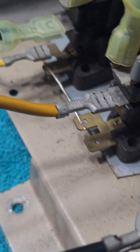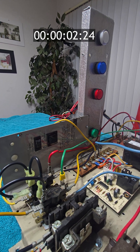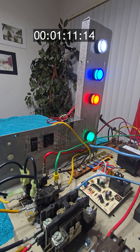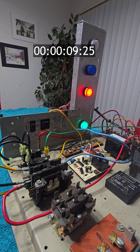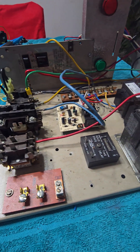If you don't want that, you can simply cut that bar out and run different control voltage so they can be powered independently. Let's turn it on and see if it works — we have power on. As we hear it click, we should start seeing lights come on. There's the first one. There's the blue, there's the white. These are rated by how many seconds it takes to sequence on, as well as sequence off — so when I turn it back off, they're not immediately going to go off. There's the first one sequenced out, and there's the second one. Hopefully you found that entertaining and learned something — let me know what you thought and if you want to see more about these other components.